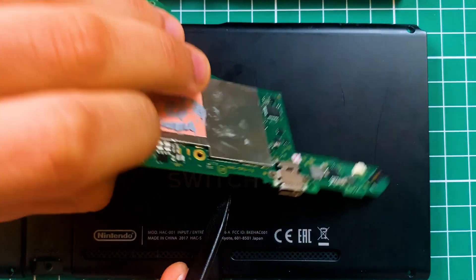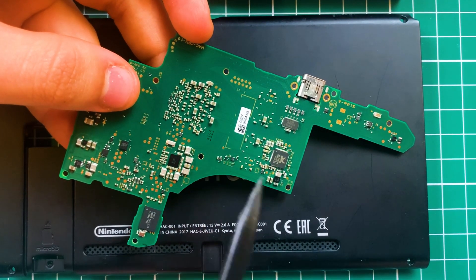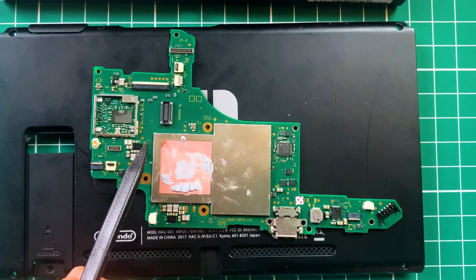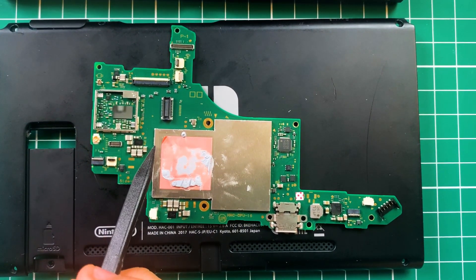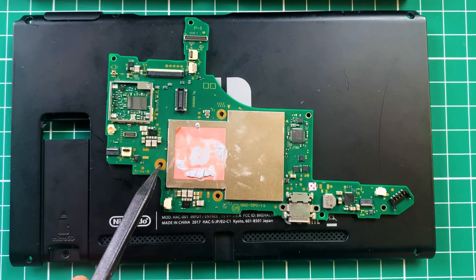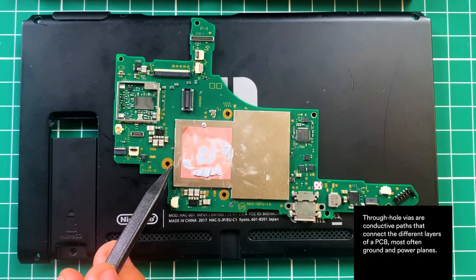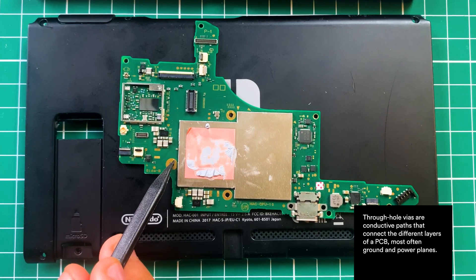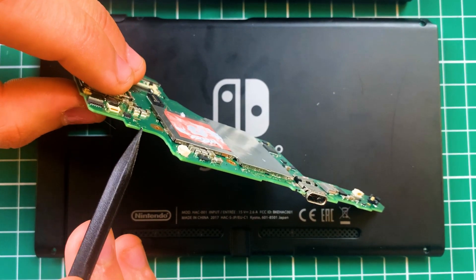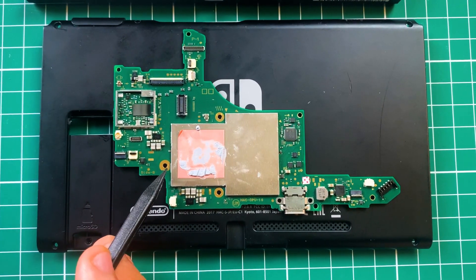The motherboard has two sides — you can see it's a very complex, elaborate PCB. It's very complicated to design these routes. The PCB communicates from one side to the other through these yellow circles called through-holes — like a bridge between one floor of the PCB and another. In some very large PCBs they can have like five layers, with cables running inside the PCB itself.